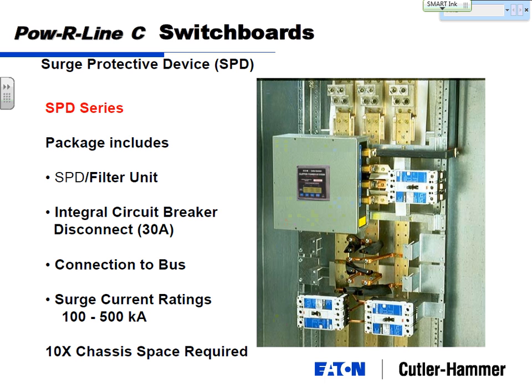Same SPD concept applies. Switchboards, just like in meters, any service entrance point of a switchboard needs to have an SPD, a surge protective device, because the switchboard is the first point where any lightning surges are going to come from external into the building. So that's the first point of protection. We always believe in the cascaded approach, where you'll have an SPD at the service entrance, maybe one or two in a distribution panel, and then your point-of-use plug-in surge strips. Each one of those levels as you go down in the system is going to increase your protection that much more.